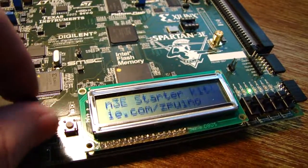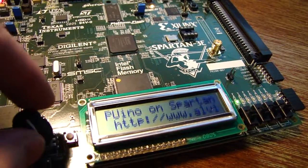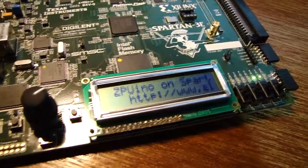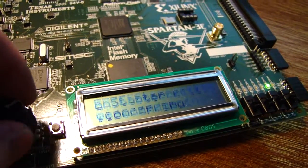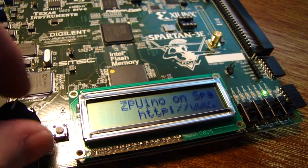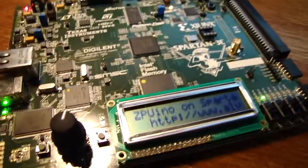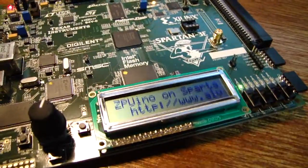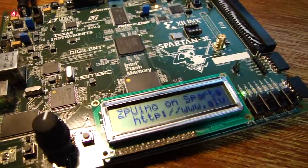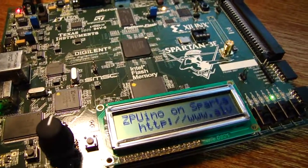The upside is the GCC compiler obviously works because this code was compiled and uploaded to the CPU. The CPU obviously works because it's jiggery-pokering the LEDs and it seems to be working. I've looked at the source code for the CPU and it's understandable — I can certainly hack on it, so I'm very happy with it. The CPU is not going to be used for a lot, just for sort of a user interface. Most of the intelligence will be in state machines inside the FPGA. One thing that's a bit of an issue is the CPU is written in VHDL, which I don't know very well — I'm much more comfortable using Verilog.